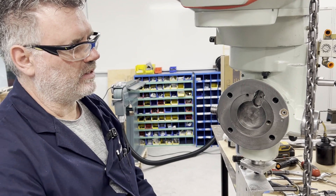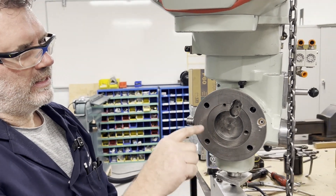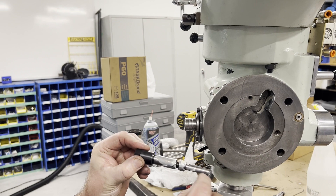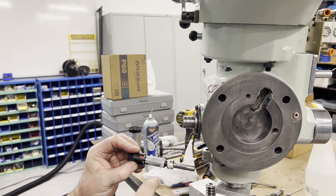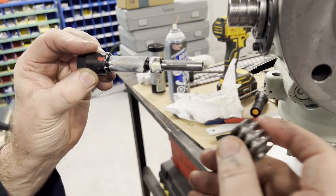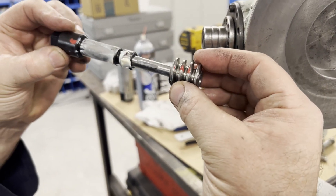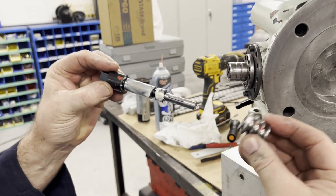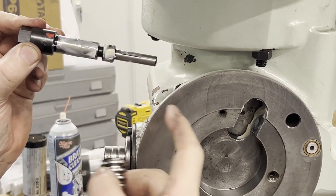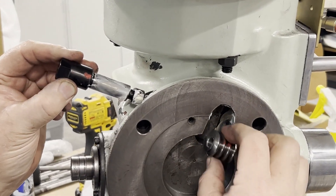I've cleaned it up, degreased it, gotten rid of all the metal filings, chips, and debris. I've oiled the cast iron and packed grease into the blind hole and greased the shaft. I've installed the key and oriented it with a mark of paint pen, and also marked the keyway on the worm so that when it's in the hole I can align the parts so they go together nicely. Here's the groove for the set screw to hold it in position, and that lines up with the hole.